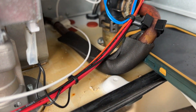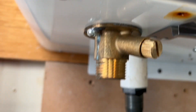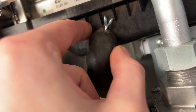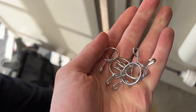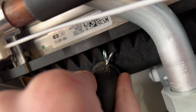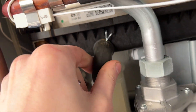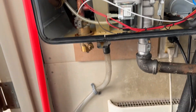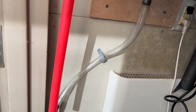So I'm at another Bosch — a Green Therm, which I just installed personally with Peter in September, so about three months ago. You can see here: water, corrosion, corrosion. This fitting right here does not hold on secure enough. It did not have that clip there. I have a bunch of these little clips and I was able to get one that fits on there enough — now it's really on there and it can't just fall off like the other one did. So hopefully that should fix it. It does provide nice hot water and it is super quiet.